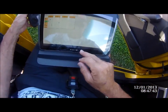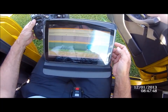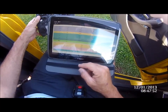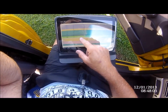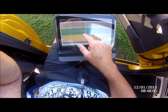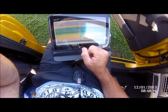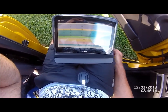You can go into your PIDs here and have a look and change them. I'm not going to change anything here, but you can go in — here are all my PID settings. Our level setting: I've taken the I out of this — it was 0.01, so I've removed that. Everything else is standard.